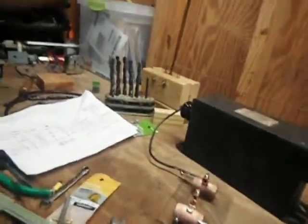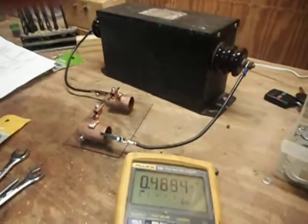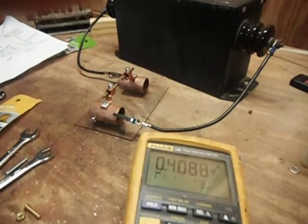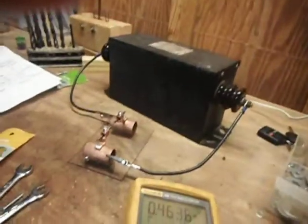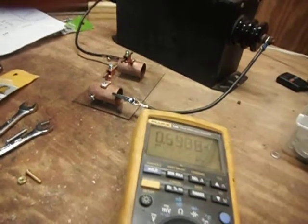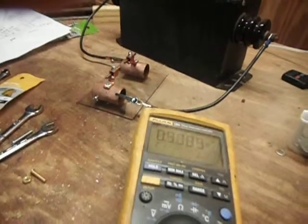What I've been told is you don't want the arc to kick in until about 120 volts. I've got mine right now kicking in at about 110, just for safety. So the line power here stays at about 125, but I want it kicking in a little underpowered so that I don't burn my transformer up. I'm assuming 110 — I don't know the math — but that gives you a little bit of a safety factor.